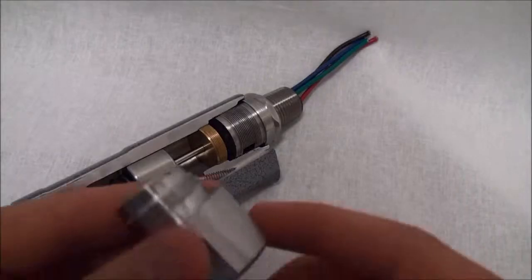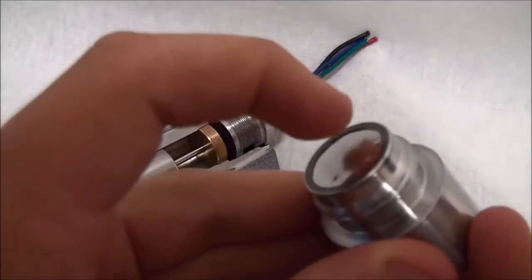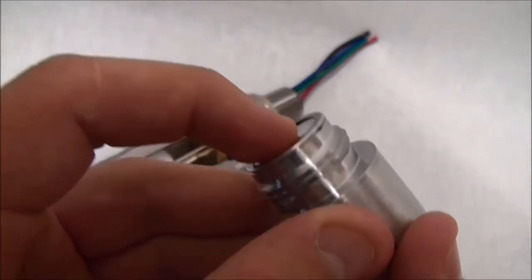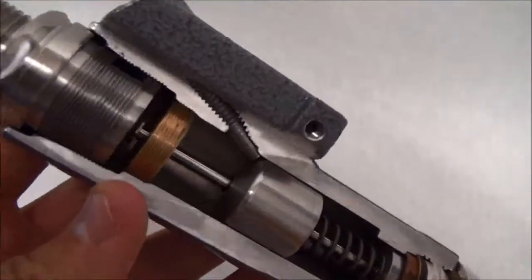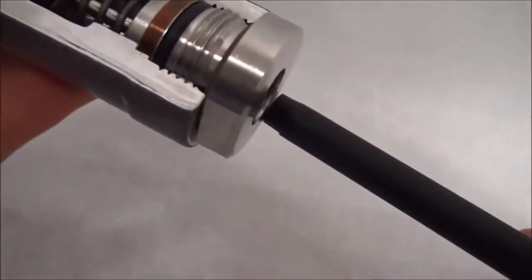When the Mini Hermet is connected to the process line and is under pressure, the diaphragm flexes. The higher the pressure, the more the diaphragm will flex. The movement of the diaphragm pushes on the piston causing it to move as well. When the pressure reaches a certain value, the piston will move far enough to come in contact with the switch and activate it.